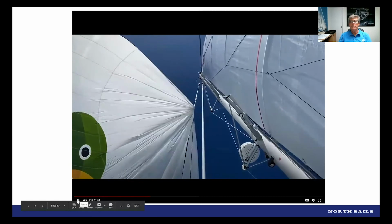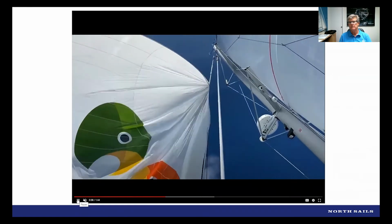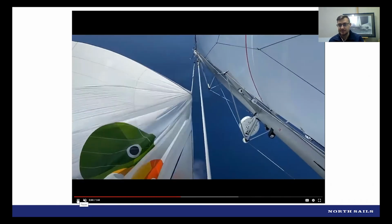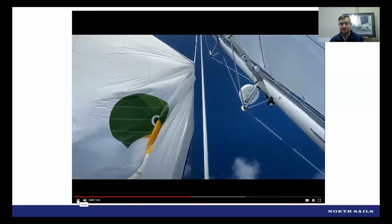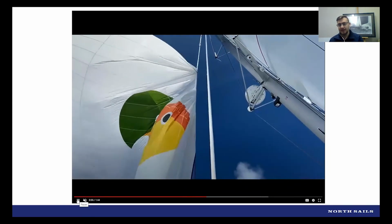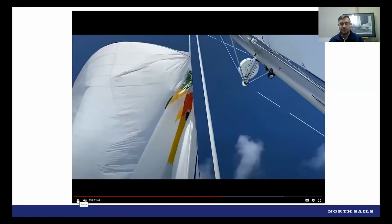And why is that important, Ben, to have it go top down on a free flying, free luff? Well, you can't go bottom up on something that's got such great girth and depth. You'll end up with a big loose mess. So by going top down and capturing all that fabric, as you can see in the video, and getting a nice tight furl up top, you're getting rid of the windage on that sail. And your soft, lightweight fabric is bending around that torque cable.